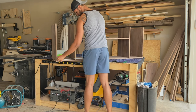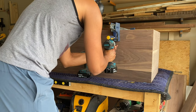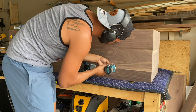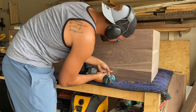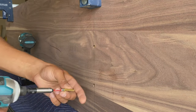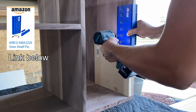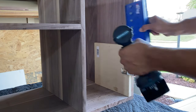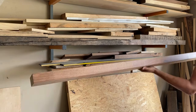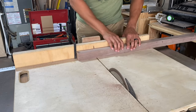To show that the Domino isn't the only way to attach things, I decided to use screws through the underside to lock the center compartment in place. I wanted to make sure the cabinet could fit several different things depending on need, so we added shelf pin holes for an adjustable shelf in each cabinet side. Now that the carcass is at a good stopping point, we're going to pull some stock for our base. The base will consist of two components: feet and apron.